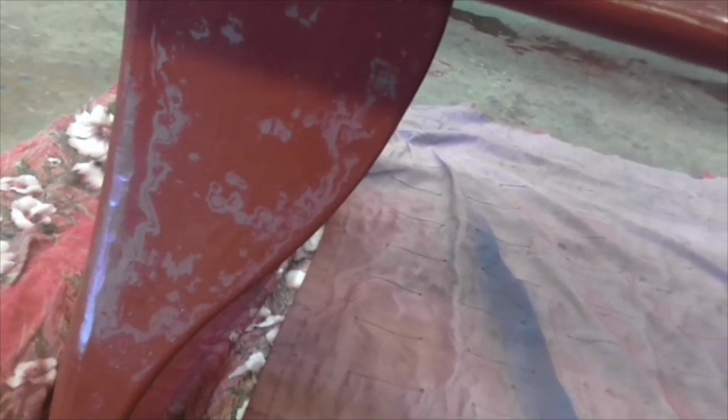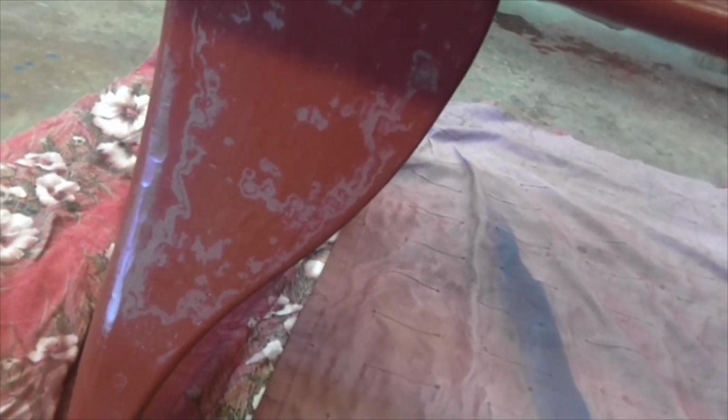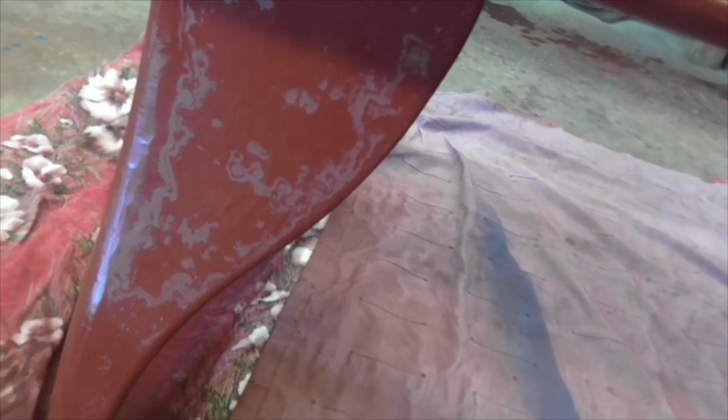There's several ways to get around it. You can use what's called a separator coat. You can spray a very dry coat on and build up a very dry coat over it. It's only doing it on the legs, which is where I left some of the original black paint on. It might have been as well to take it all off. Where it's all come off the chip tray, it's perfect.